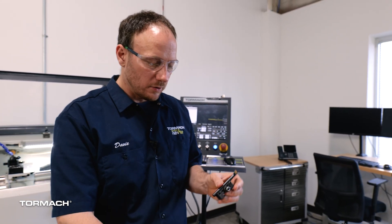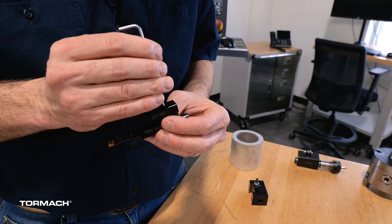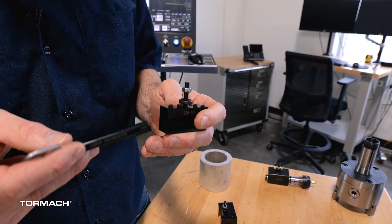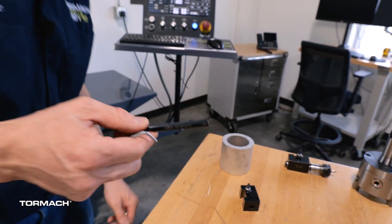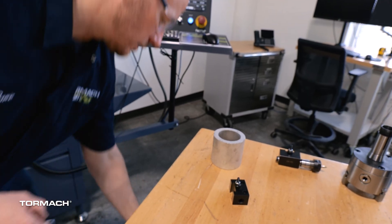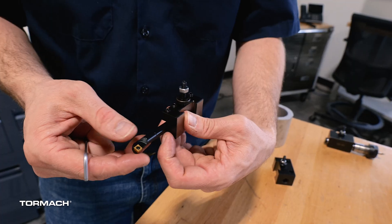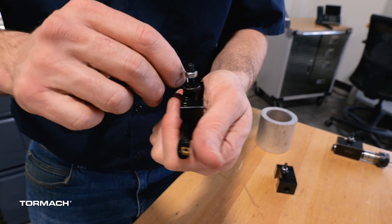The install of the tool in the tool holder is pretty straightforward. I'll do this in a backwards way so you can see what I'm doing. I'm going to loosen all these set screws up and get this thing set in. I'm using a boring bar holder that's got the V-notch in the bottom of it, and that's for a round shaft boring bar. This one has flats on three of the sides, so I could actually use a standard turning and facing tool holder, but I'm going to stick with the boring bar holder. I'm going to insert this — when it goes in the OXA tool post it's going to go this way, so I'll give about an inch of stick out. I'm going to put these good and snug so it doesn't pull out of the holder while we're cutting.